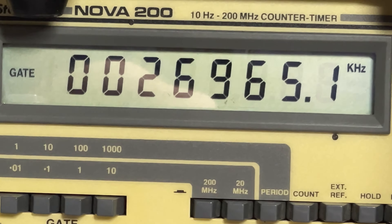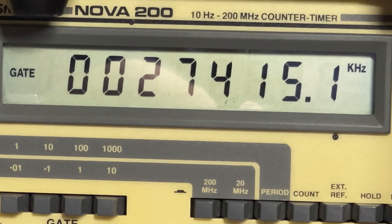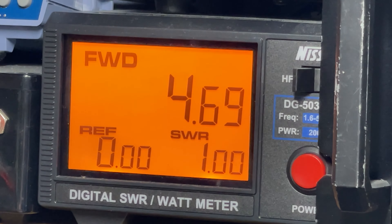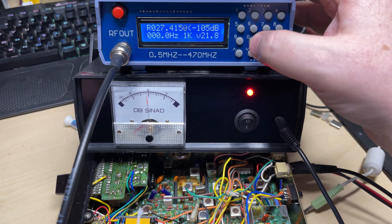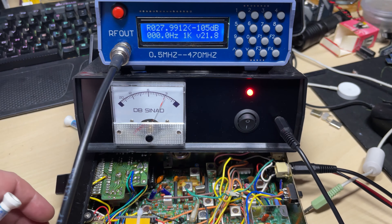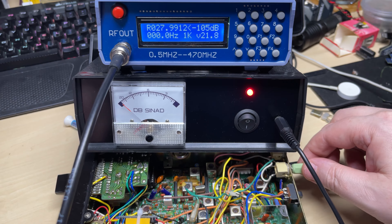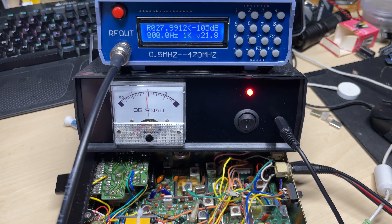And that was our offset board fitted. So mid band, high band, UK40 with offset — close enough. A little readjustment of the output stage just to get it level across the bands, and that's good enough. Having a look at the receiver — everything's looking good on the receiver. Just had to adjust it to level it out a little bit across the bands.